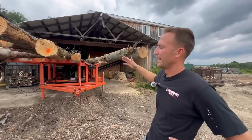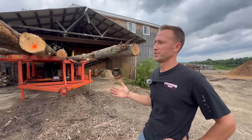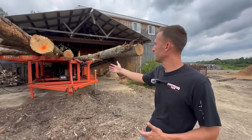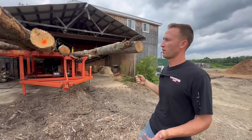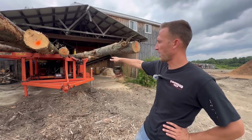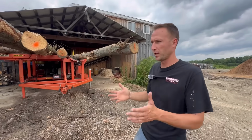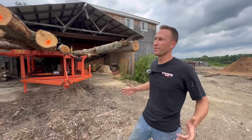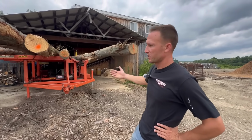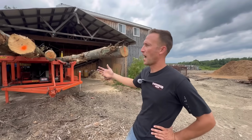Yeah, which I think you can see in the firewood processor market. Every firewood processor company is trying to come up with a solution to reduce resplitting. There's a million different ways to do it. This is how we decided to do it. I'm not a big fan of box wedges. I don't like having to force the wood through and make it the size you want. I like something that floats, which both this processor and that auto splitter do. They float around the grain a little bit to give you that natural split look, instead of shearing it off. Right, and still give you that uniformity you're looking for. And cycling back through the splitter just takes time. At the end of the day, it adds up to more hours per cord.